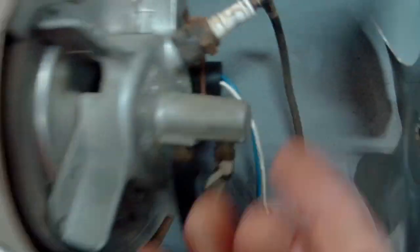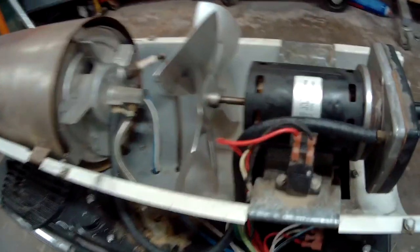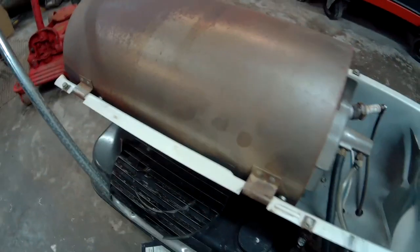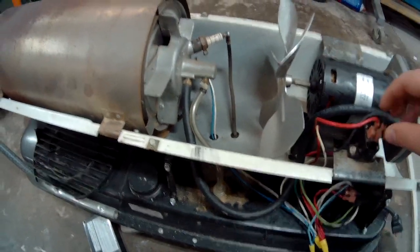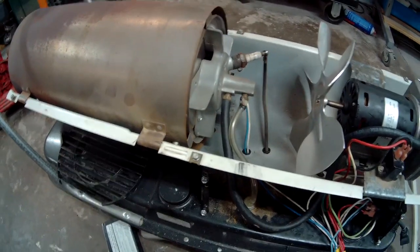There's your old photo eye down underneath the spark plug. There are your fuel lines — we replaced both of them because they were both cracked when we got it. We also replaced the air filter. This is the part that burns the kerosene; we're running straight kerosene on this heater. I've seen where people mix it with gasoline but I'm not sure if that works — in the future we'll let you know. Now we're going to start by getting the old photo eye out.